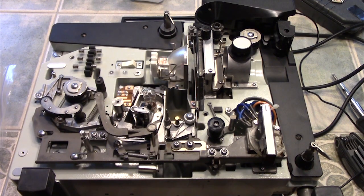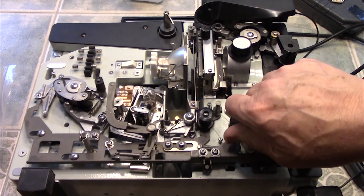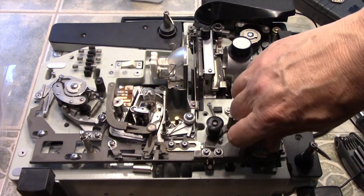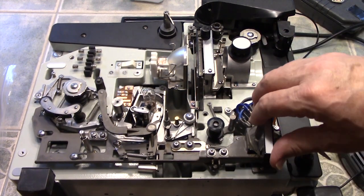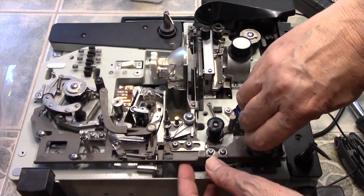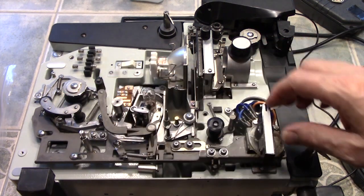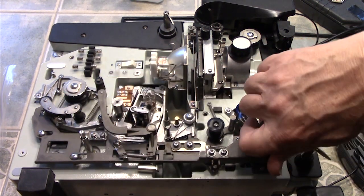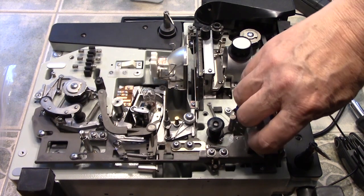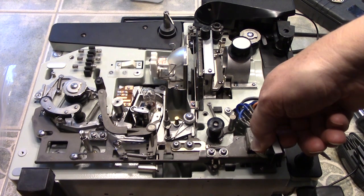The projector is laying on its side so we can put the rollers back easier. First, we're going to do a test to show how the mechanism works — when you put it into gear, a whole bunch of things in the bottom start to engage. We want to look at places that move. These two screws here hold this plate on, and we're going to lubricate those points, as those are the ones I think are most important.